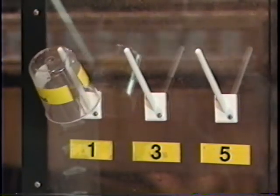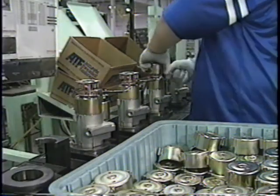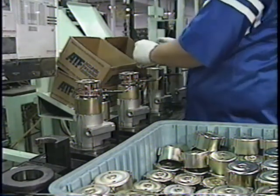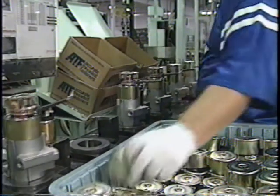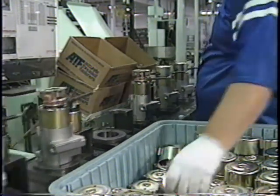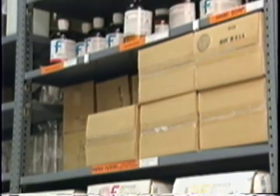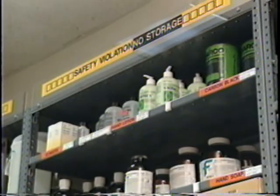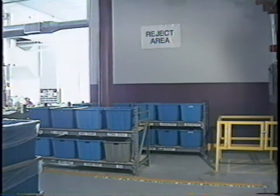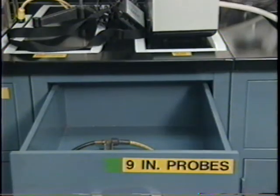The third Set in Order guideline is to make everything easy to get or put away properly. Keep safety in mind. Consider improvements that will prevent strain and other injuries. For example, surfaces can be slanted slightly so that items can be reached and put away easily. Also, items can be stored on open shelves for easy access. The fourth guideline is to get items off the floor whenever possible. Clear floors are easier and safer to move around on, and also easier to clean.